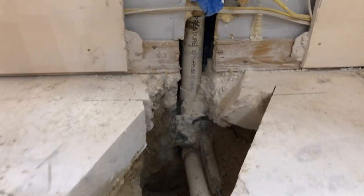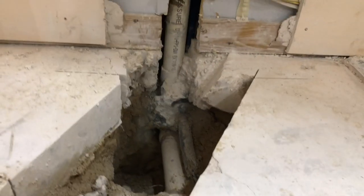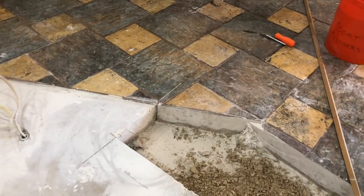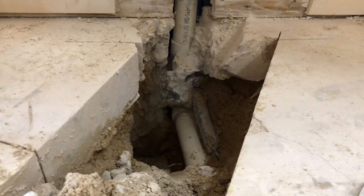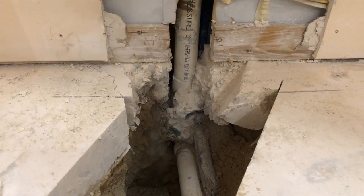What I need to do is get all of that concrete out from around that pipe, because I want to tie into that pipe — ideally in the vertical but as close to the drain as possible — so there's a good pitch down from where the new sink will be. It was poured in the stem wall, and you can see this is an exterior wall. Less than ideal, but it's slowly coming by drilling it and then chipping it with a hammer.